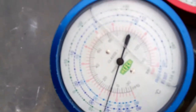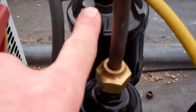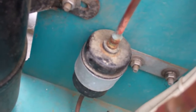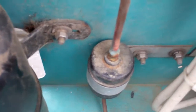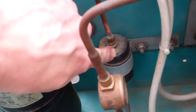Right, we've got that pumped down now - I'll just go a bit lower. So we've got a dryer in the liquid line, a dryer in the suction line because it's had a moisture issue in the past, and we've got another dryer in the liquid line - just in case, one wasn't enough. So that's been there all the time they've been having moisture issues.